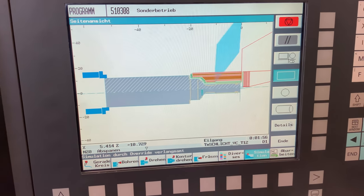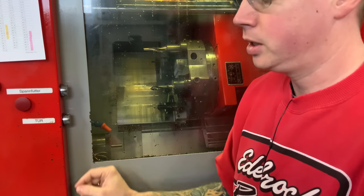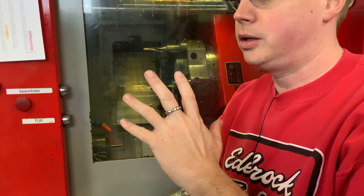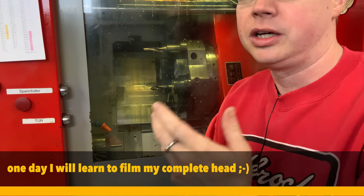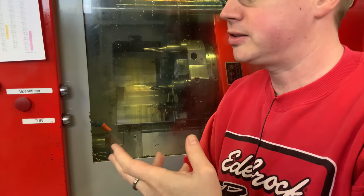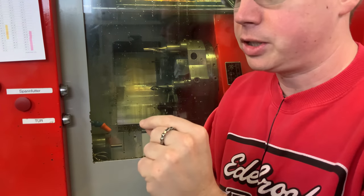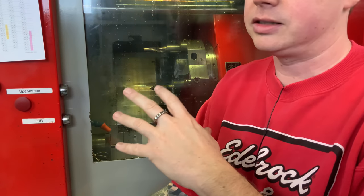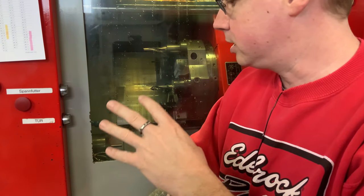I'm making some progress with the programming. This is really just for rough tests and even the dimensions are not correct. For the first cut, I need to be really, really careful because we are not using normal coolant — we are using cutting oil on this machine, and working with titanium creates a lot of heat. A lot of heat plus oil creates the danger of a huge fire and explosion. This is why I need to start very carefully with these small dimensions. I never learned to use machines like this, so everything is learning by doing. Back then I didn't even know how to start a machine like this or where the on and off switch is. Since then I've learned a lot, but with new stuff like this I'm always really, really careful.